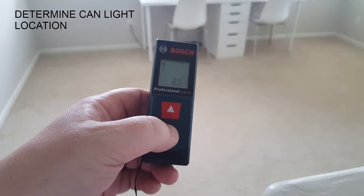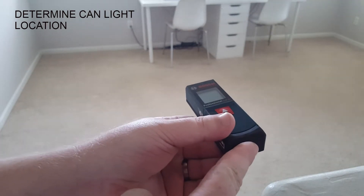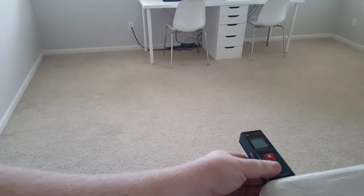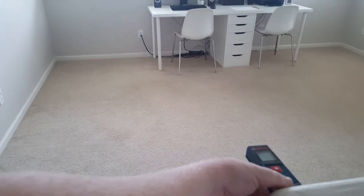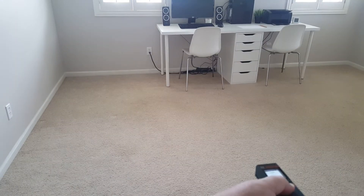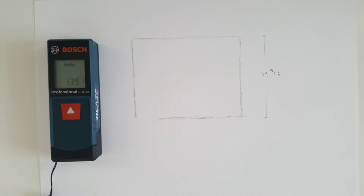Another key component of the planning phase is to measure out the room so you can decide where you want the cans to be located. With this job I'm using a laser distance measuring tool — this measures from the back of the device. I'll put the link to the product in the description. I think I paid $30 on Amazon. We're basically measuring 139 inches to the back wall and plotting that on a piece of paper.